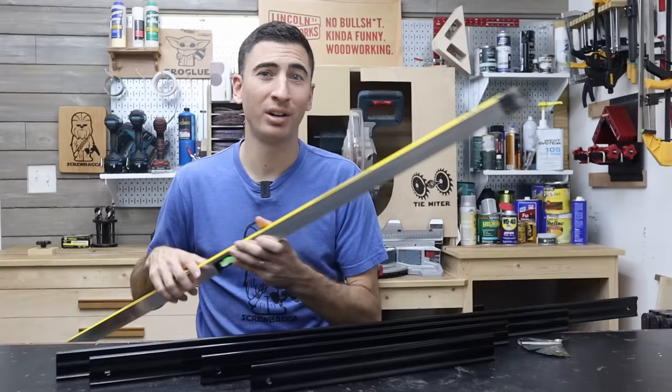Once you start to go all fine woodworking in your shop, you'll learn that a pencil is only as accurate as your eyes, but a marking knife is as accurate as your tools. Think about it this way. When using a pencil mark to line up a cut, it's a bit like a car driving down a windy road, while the marking knife lines act like tracks for a train.